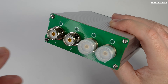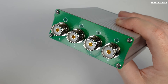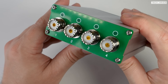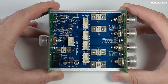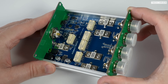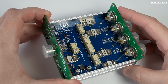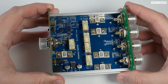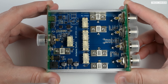When one of the LEDs is illuminated it means that port is active. Each of the four ports plus the single port will be terminated with its own internal 50 ohm load resistor, which is activated on that port when another port is in use. Inside, we can see Omron relays used on each of the ports along with a 50 ohm flange mount termination for each port, rated at 150 watts each from DC to 2.5 gigahertz. These protect your radio if you accidentally transmit on a port that's not selected.